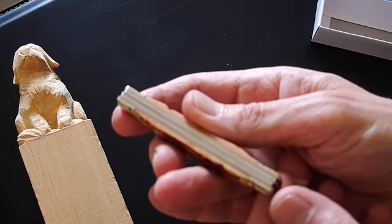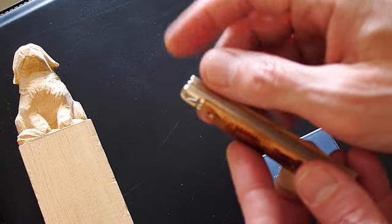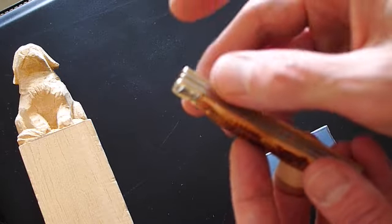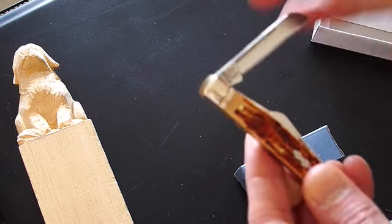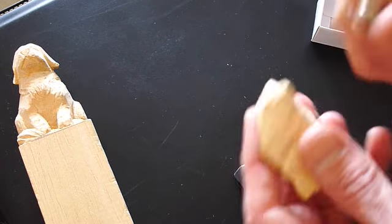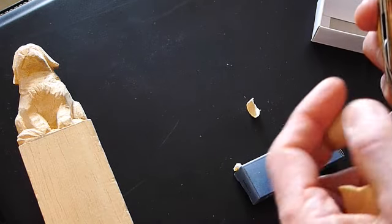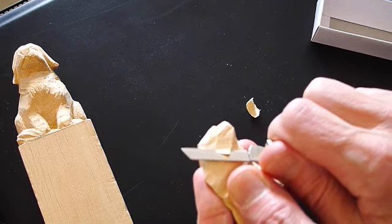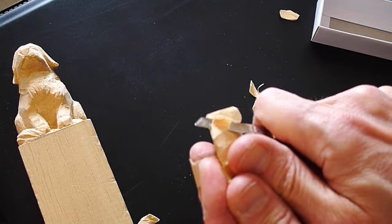And this knife, for me, is a case in point. The only small detail that's not quite right is on this edge — the brass liner is about one sixty-fourth of an inch above the back springs. I'll just take a fine file to that and bring it down. Everything else — the fit and finish, the quality — the 440A stainless steel blades, when I tried cutting with them, they have a factory edge and are sharp, though not quite sharp enough for carving, except for the coping blade. They put a better edge on that in the factory, and it cuts very, very nicely. They seem to be well-tempered; I think they'll keep an edge fairly well.